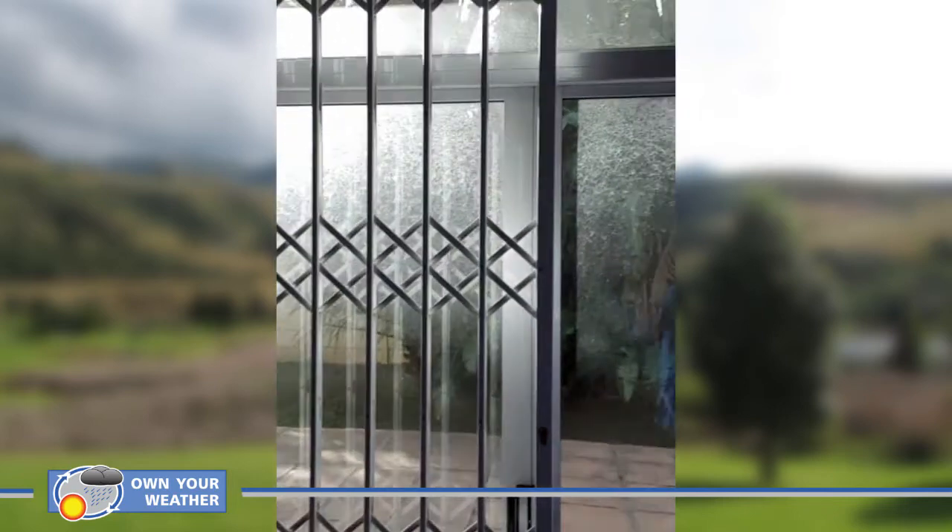Another location to avoid is a room directly facing the sun with large windows. Sun shining in through those windows directly onto the weather station will completely distort your thermometer readings. I know it's not always possible, especially if you live in a bachelor flat with a window facing the sun — just never place it directly in the sun.